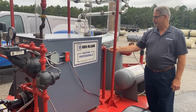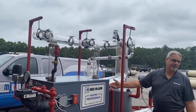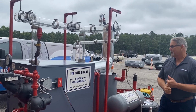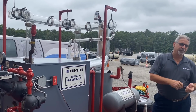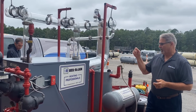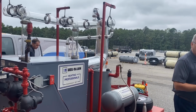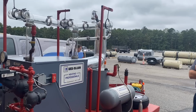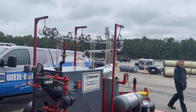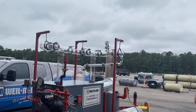Drain water or release it. But I have my relief valve here, 15 psi, with proper capacity. Relief valves don't just have pressure ratings, they have capacity sizes. This boiler is firing about 300,000 BTUs, about 2.5 gallons of oil. This relief valve is rated at 450 pounds per hour, and since BTUs are based on pounds, 450 pounds is 450,000 capacity.